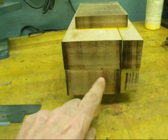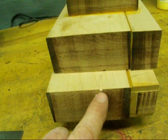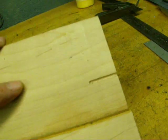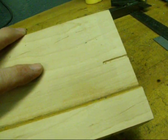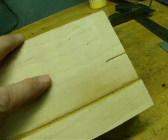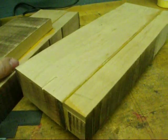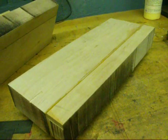We'll also need center holes on both ends. I've initially milled some little grooves in there so that when I drill the center hole it will be truly half on one side and half on the other, similarly with the other end. Those were laid out very carefully — you've got to think a little bit ahead when you do this. It's already getting a little bit long here, but stay with me. So I'm going to glue these together, drill those holes, and then continue with this tomorrow.